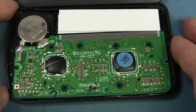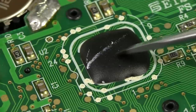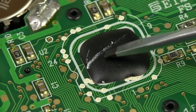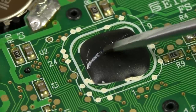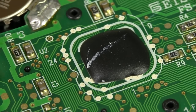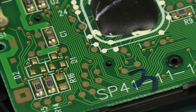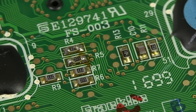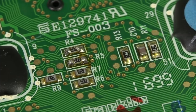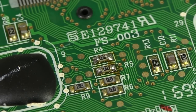They'd churn out a million of these things. There's our custom ASIC — just a bare die, chip on board. COB technology: the chip is mounted directly onto the board and the bond wires are welded over to the individual traces. Very cheap technique. Check out all the test points — practically every line has a test point. There would have been a big bed-of-nails tester for this. And look at some of the shoddy hand-soldering — pretty awful. It was late on a Friday afternoon, they couldn't wait to get home.